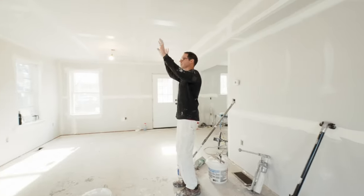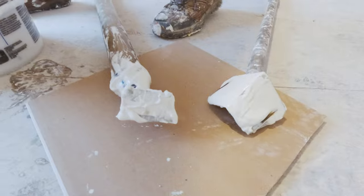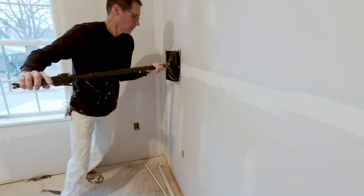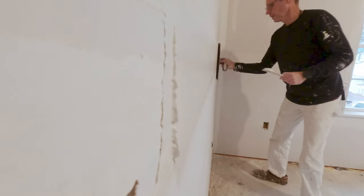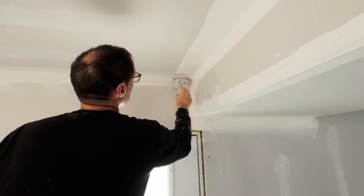I've coated all the seams in this room and all the inside corners using the automatic tools — the box and the corner finishing tools. It was easy and I got really excellent results. These tools are not complicated to learn; the learning curve is a lot shorter than it would be with hand tools. It's nice and consistent — exactly 10 inches wide, feathered out nicely on each edge. Even the inside corners have both edges feathered in really nice, all the tape is concealed. It only took minutes to do this whole room. But now I've got to point up all the corners and blend in the butted seams — there is always a little bit of touch-up with the hand tools.